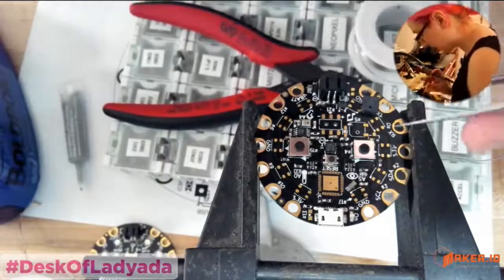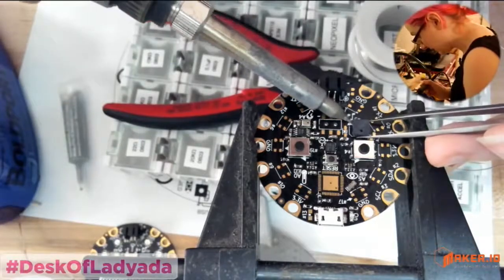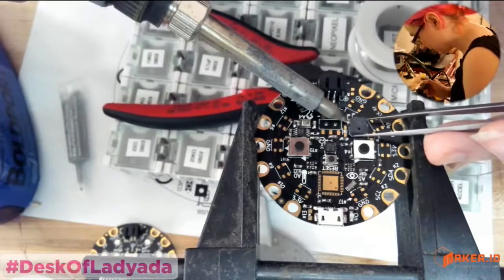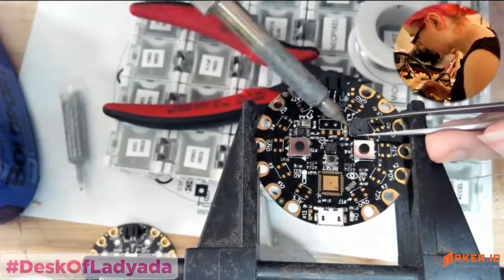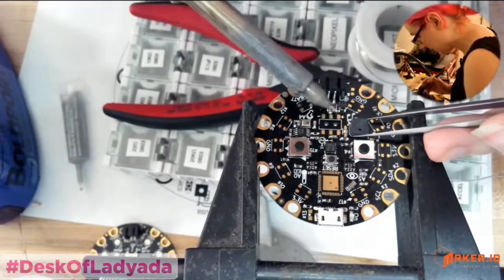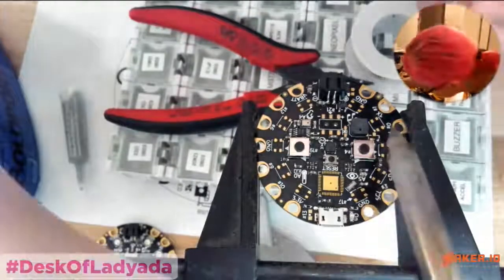One of the nice things about this is, why not use a piezo? First off, piezos tend not to be as small. And for reasons I'm not 100% sure of, they never come in surface mount friendly packages. So if you want to have something pick and placed, you do have to spend a little bit more and get a buzzer.